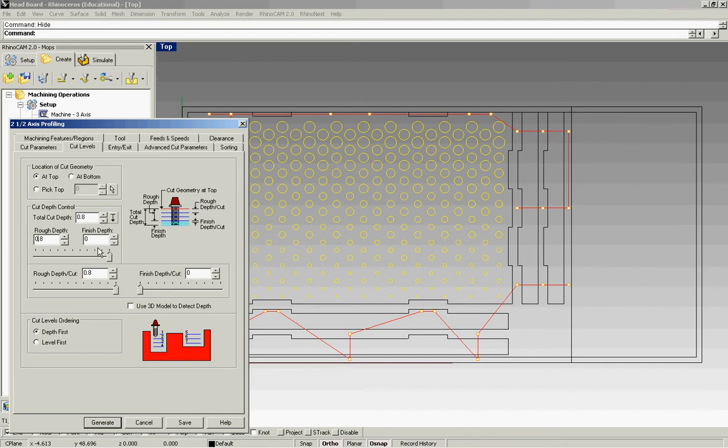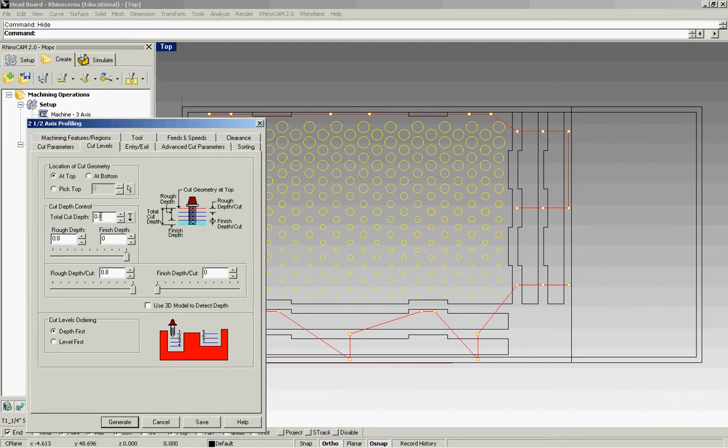And this will vary. If you're following the flip mill, this would actually be different, just for the fact that there's only 1/8 of an inch of material to cut here. But if you're watching this tutorial to learn how to profile, we're going to treat this as if we're profiling through the whole piece. Sorry if that sounds confusing. It's just a matter of changing our cut depth.